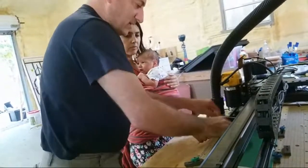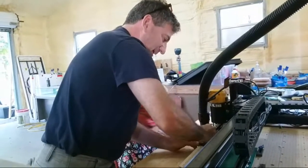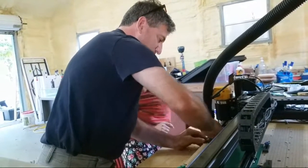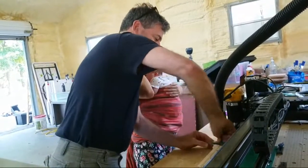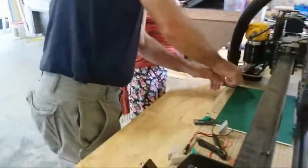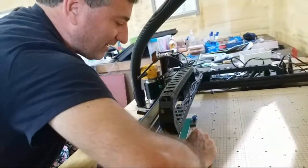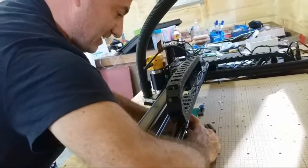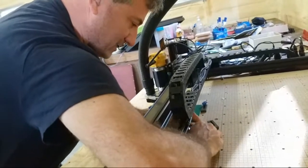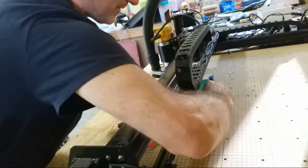and try to get it bolted down at 4 corners. So there's one here. Since this is already screwed in, I can lift it from my last carve with the blue one, although the blue one takes a lot longer, and just carefully get it right at the edge so it doesn't interfere with the drill bit. So those two sides are clamped down. Now I've got this one here. Again, if you're using the same size, which we're not always, then it takes a little bit less time, you see, because you've already got the clamps more or less in place. Same size of material. Yeah.